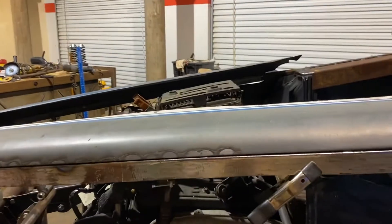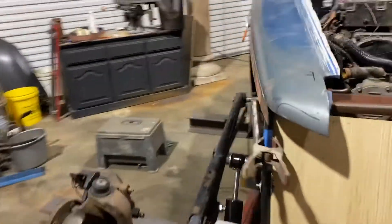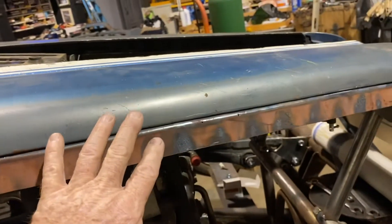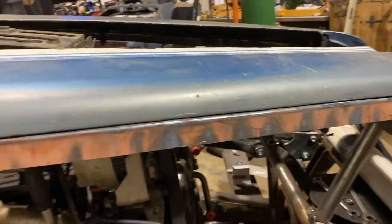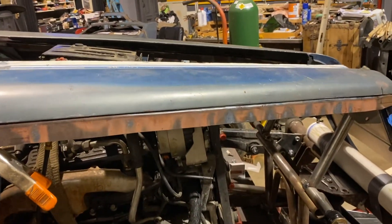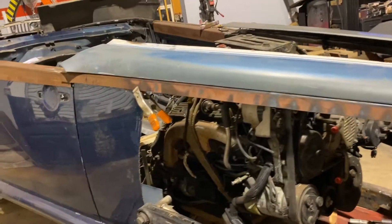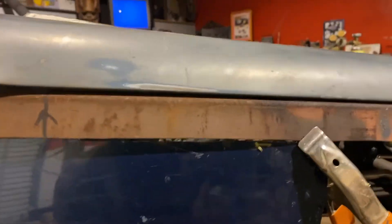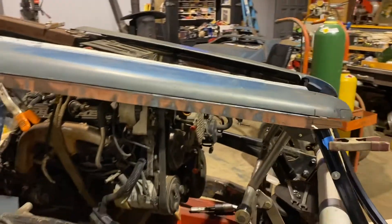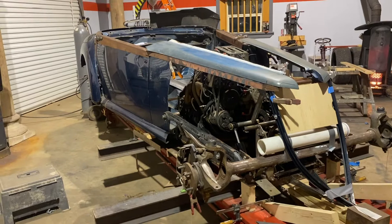A little flame straightening — nothing to it. Touch this with a little flame here and it sat right down on it. I built this other piece just like I told you I was going to build, and it had a little gap here too. I touched it with a little heat and it got a little bigger. Then I took it off, took it over to the bench, and tried to bend it straight. I heated it some more, and then I heated it again — I must have heated that thing six times. I don't think I'm any smarter about flame straightening than when we started. But it's an interesting subject and I wish you'd look it up. I finally got it to sit down on there and it's usable. I ain't touching it no more — I've had enough of heat straightening. But I am interested in the subject and it's amazing what they can do. You should look it up. Thanks for tuning in.